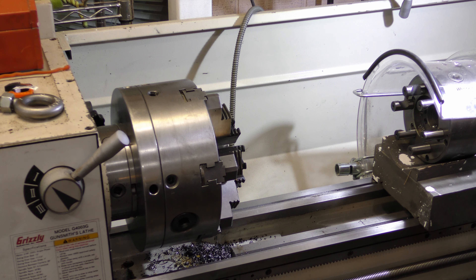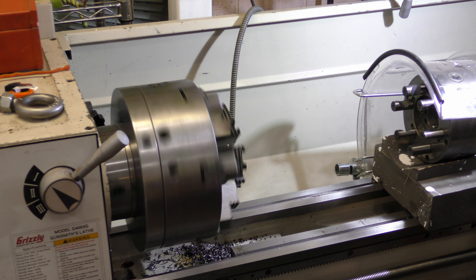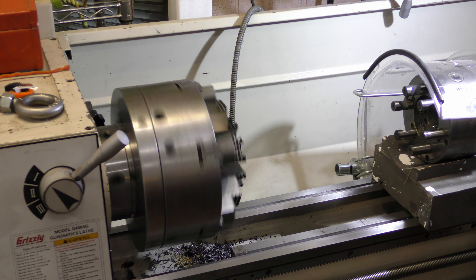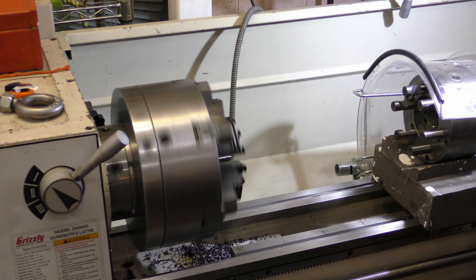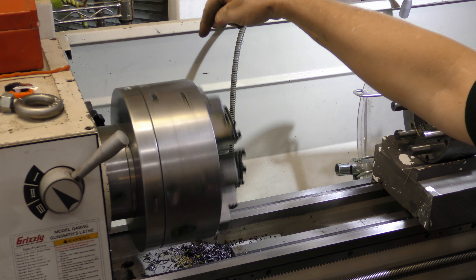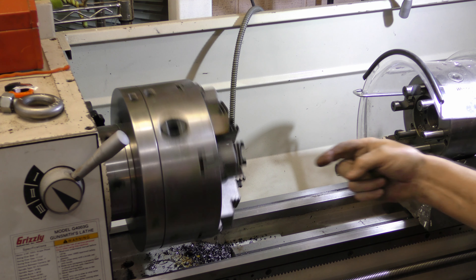The spindle of this machine was not really built to take 93 pounds. You can see I haven't centered it up yet with the screws. I'll have to put a pin in it, run a dial indicator on it, and then center up the four screws like a four-jaw chuck to get it back where I had it. But the other problem is that this casting is more dense on one side than the other. So I'll be stripping it all down one of these days, putting a sensor on the lathe and balancing it.